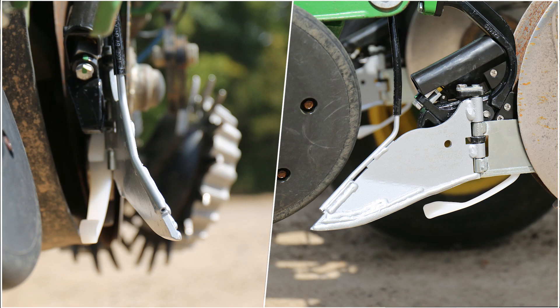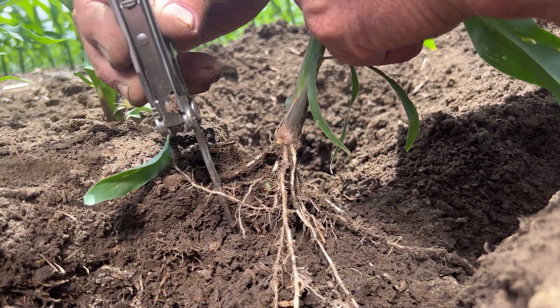One of the challenges designing the Wave system was making the blade in such a way that it would cause no damage but still do what we needed. We're three quarters of an inch away from seed and need to maintain that very carefully. The shape of the blade is very important — the angle it's bent at, the angle the bottom runs — all of those things matter heavily because we're counting on the blade shape to steer it and keep it away from the seed. This is very soil-type dependent, depends on residue and soil type. What really mattered was crawling on our knees in a cornfield watching the blade run, looking at the corn plants later, digging seeds — we spent time in Texas, Illinois, and many other states.